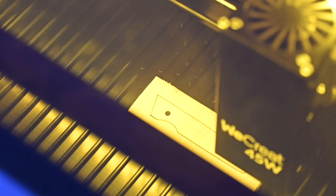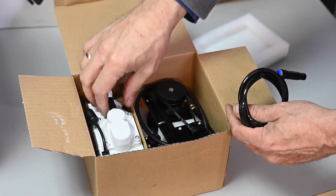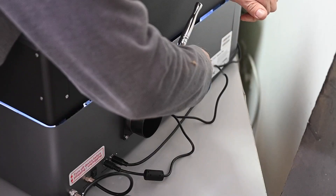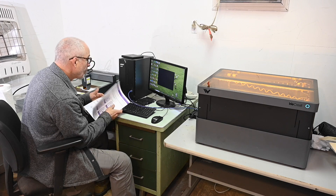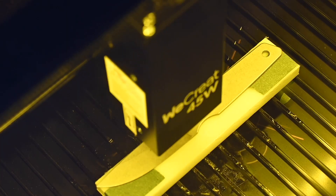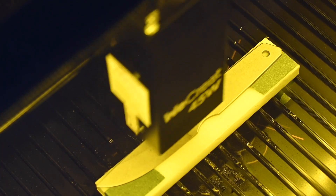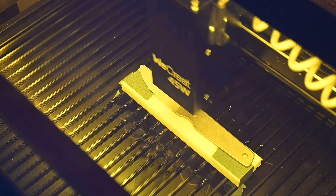What can you print? Basically anything — images, vector graphics, whatever. Setup is also pretty straightforward. It's a pretty plug-and-play item, though of course you have to install drivers and do a little fritzing around with the software. In my case, I actually had some issues with my computer recognizing the laser, but it all sorted itself out eventually. The most obvious use for knife makers is in making logos and other markings on knives — you can etch things into the blade, etch things into the handle, whatever. For years I spent quite a bit of time individually etching every single one of my blades with my logo using an electro etching system. Once you start using a laser, you will never go back to electro etching. It's just hugely superior in just about every way.